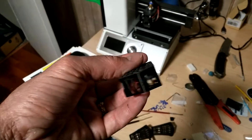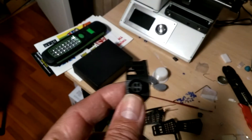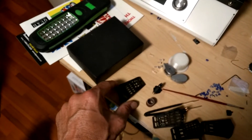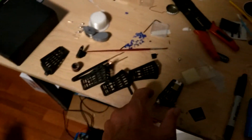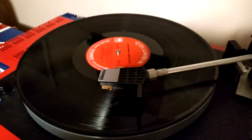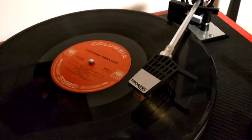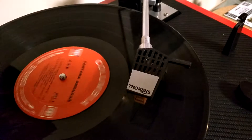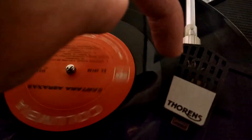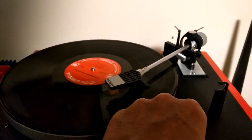I made one version with the 8mm hole that fits the bullet perfectly — one with a finger lifter and one without. Here you can see the holes where you stick the wires through and solder on your headshell leads. Here is the actual working version: it has the aluminum bullet from Italy on it, and I also found a place — I think in Russia — that clones the Thorens aluminum plate that mounts on the shell.